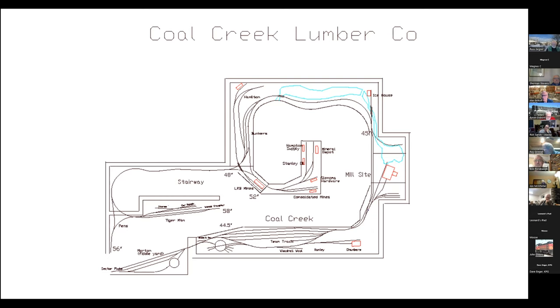Well, the thing about this one mill at Converse Basin, they had a thing called a splitter. These gigantic logs, 15, 16 feet in diameter, they cut into four sections initially with a huge bandsaw, this 96 footer that I just first mentioned. The log was laid on a cradle that was like a fork, between the two tines of the fork, and was pushed through the saw and cut in half. Then those halves each were cut again using this splitter, and those big chunks of wood were then sent through the regular mill process.